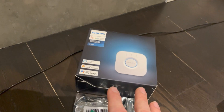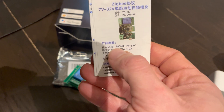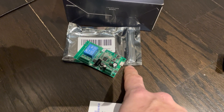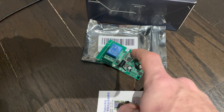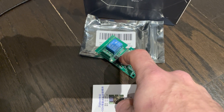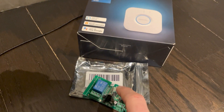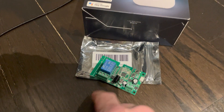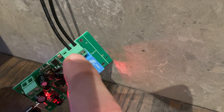Starting with the Philips Hue solution, this smart relay is designed to be fed — supplied with 7 to 32 volt DC or AC — that is wired into those two posts. This smart relay optionally takes a USB supply at five and a half volts. There's the actual smart switch, that's the Zigbee antenna there, and that's the relay coil. So this Philips Hue bridge is going to be controlling this Zigbee relay. And then we've got normally open, normally closed, and the common post. We know that this circuit is normally open, so I've wired the relay into the fireplace using the normally open and the common posts.